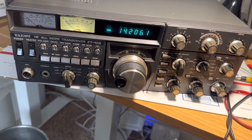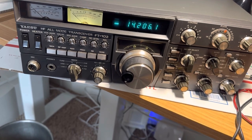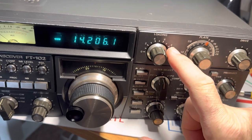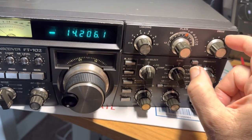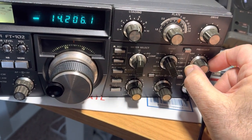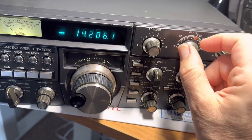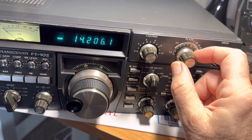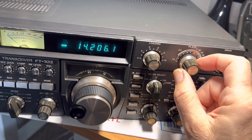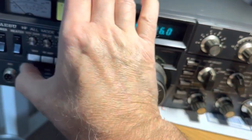I put the final cage back together and didn't really neutralize anything, but I'm on 20 meters and this thing puts out some juice. I have to calibrate this knob — it's really sensitive with the loading, you can move it only by a few degrees and it gets all screwed up. The drive is also rather sensitive. The preselector works reasonably — you pick it for the best drive, then use the drive to set how much current to give the final and how much power to put out, then tweak the loading. The plate dipping or power output is very broad compared to the Drakes I'm used to working on. This thing does have a gear reduction mechanism, maybe that's why it seems broad.